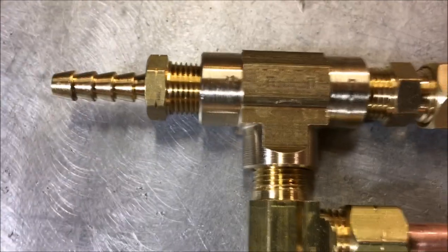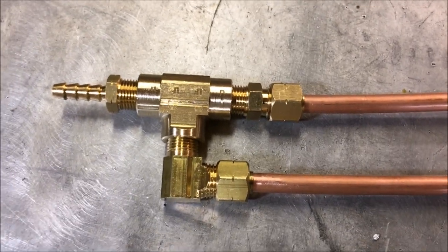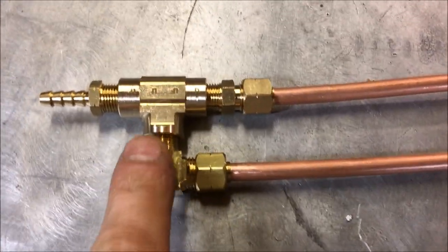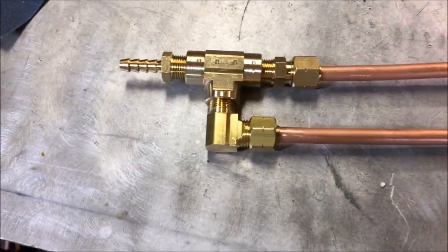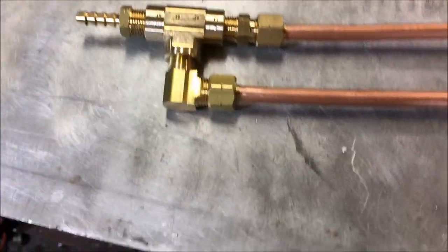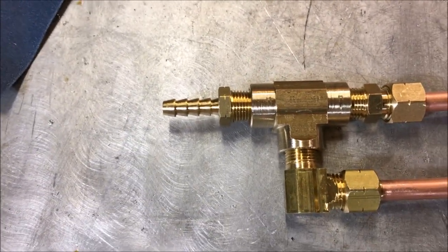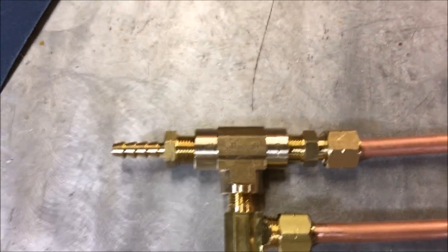But this is just the same thing. However, the airstream is at a different angle this time. Now the oil is at 90 degrees. Oil is going to come through the bottom, and the airstream is going to come across the top. Hopefully it'll rip it apart. If it doesn't work well that way, then we'll switch it back to where the air comes through this way and the oil this way. However, I'm still thinking that possibly putting a bigger cavity inside of here is going to benefit the atomization. I do have a couple of fittings, and we'll try that out maybe.